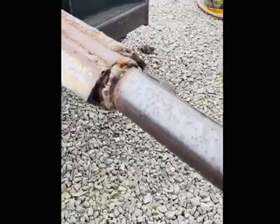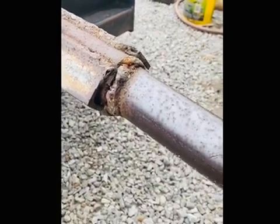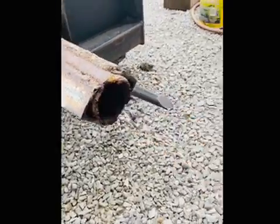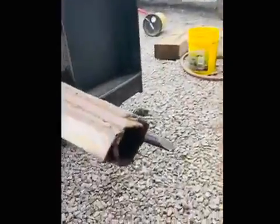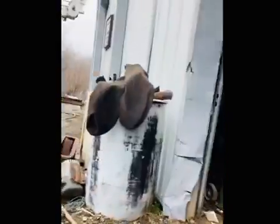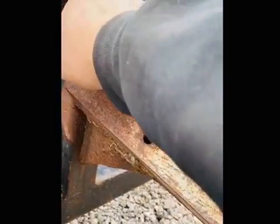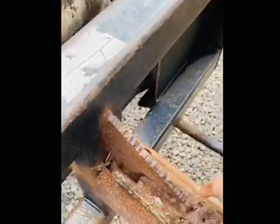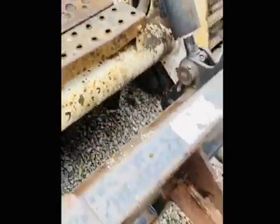Yeah, got my seat there, which is a bucket. Now I think you can see this. I think the thing's gonna just pull out. I put it on the Bobcat. Yep, see, it's already just pulling out. Throw that out of the way. And this is already a fix. So first thing I'm gonna do is get the oxyacetylene right there. I'm gonna cut it right down here, and I'll probably cut this stuff off right in here, and then on this side, and then come over here, cut that old weld out, and then cut this other old weld out.